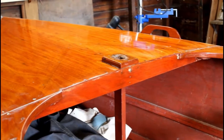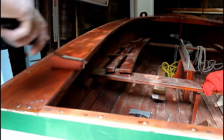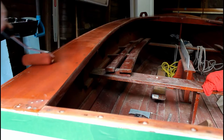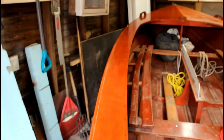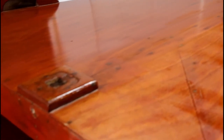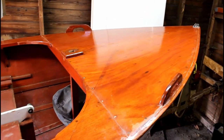With the boat deck all nice and clean, we can get ready to start painting. Before I apply the paint, you can see that the luster on it is completely gone, so this paint hopefully will add some of that back. I'm really not a skilled painter, so I decided to use a paint roller instead of a paint brush — I think this just makes the process easier. Here the first coat is on and you can really see the division and difference between the left side and the right side. This is the entire deck painted with two coats of semi-transparent paint.